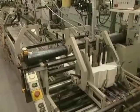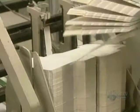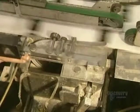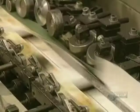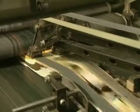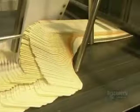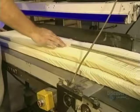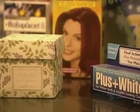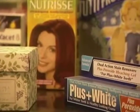All that remains is the assembly of the packages. This high-speed gluing unit can make up 30,000 to 40,000 boxes per hour. Gluing begins with the folding of the sheets following the folding marks, and the sides of the form box are then glued together. An average of between 5 to 8 steps are needed to fabricate a packaging box. Every day, this plant produces between 1 and 2 million boxes.